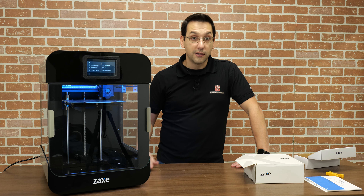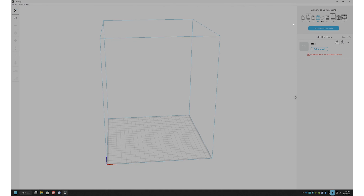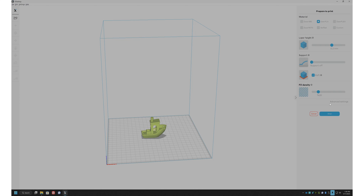For those abrasive materials I'll need to change the nozzle. This does come with a 0.4mm brass nozzle, and carbon fiber will eat a brass nozzle for breakfast — you'll want to switch to something hardened, like hardened A2 tool steel. There are also nickel-plated copper nozzles with a lot more abrasion resistance than brass. Just make sure whatever nozzle you put in is rated for abrasive filaments before running carbon fiber through, otherwise that 0.4mm nozzle will be an unknown size when you're done. Also account for heat conductivity: stainless steel is a terrible heat conductor compared to brass, while nickel-plated copper is extremely high conductivity — so if brass prints well at 220°C, hardened tool steel might need 230°C.